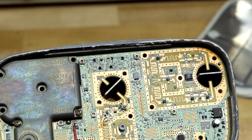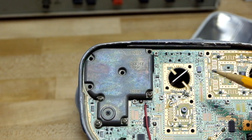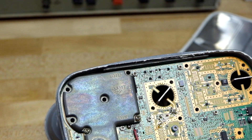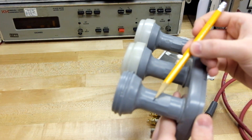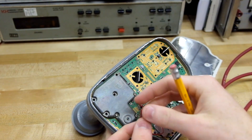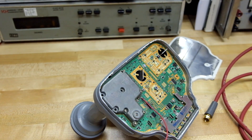This is on the 10 GHz range, which is actually the Ku band. I have the receiver output coming out through a DC blocking capacitor, going underneath the shield to this red wire, which I'm going to hook up to my oscilloscope. That signal is getting mixed with the DRO — the local oscillator — in there. So one antenna of this feed horn is transmitting roughly a 10 or 11 GHz output directly from the local oscillator, bouncing off an object, and when it comes back, the only pulses I get out of this red wire will be the difference of those two signals. I'll get a small pulse in the millivolt range when there's a difference in phase between the outgoing and returning signal. That's basically the premise of Doppler speed-measuring radar.